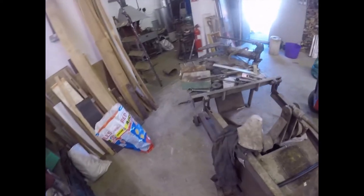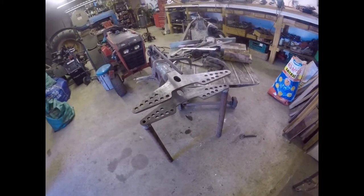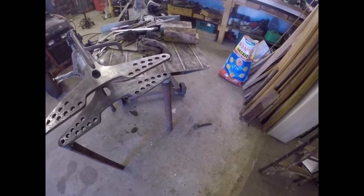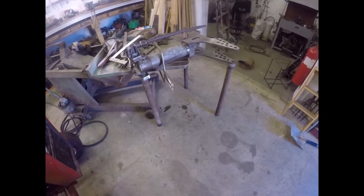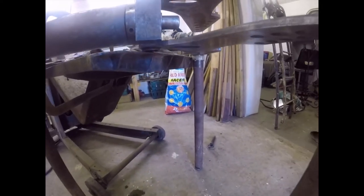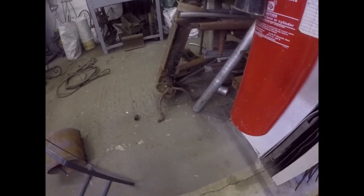Monday, 4:30pm. What have we got done? Here we have a bender, sat on its three legs. The three legs have been squared up to the floor. So the next thing to do is work out the distance between them and weld some struts on. What I'm planning is three struts near the top and three struts near the bottom. I might see what I've got in casters and put some casters on it to roll around. I've got those great big cast iron ones there but I think they're probably far too big.